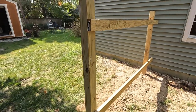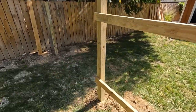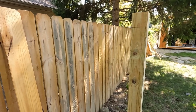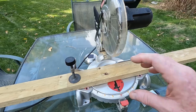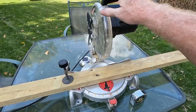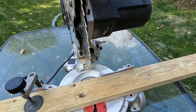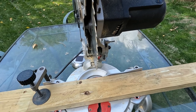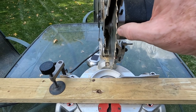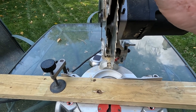We've got a good strong fence structure now, and really it's just a matter of putting on our fence panels. These I'm going to actually have to cut down, so I do need to get some measurements. It's a very good idea to have a miter saw — the kind that will either pull out and cut, or this older one that just comes down and cuts. One thing most people don't think about: if you've got a measurement, say you want to cut it exactly 62 inches, you want to cut it to 62 and a quarter. This is because of the thickness of the blade — it's a quarter inch. So if you're at 62, just go maybe an eighth to a quarter over, then you'll have a perfectly cut 2x4 that's 62, for example.